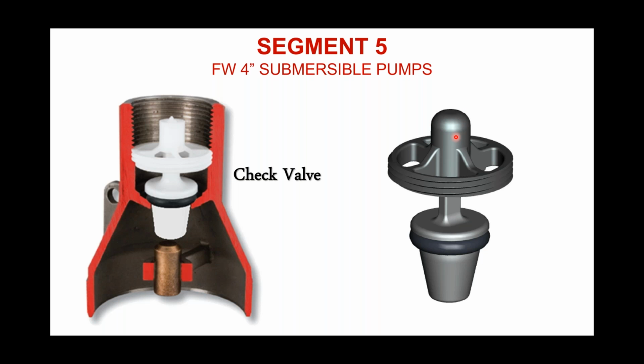For this reason, we do a lot of destructive tests at Flint & Walling. One test that we've conducted quite frequently when it came to these check valves is what we internally call the snow globe. Most of you know what I'm talking about. It's a little souvenir type of thing that kids really like a lot. You pick it up, shake it, and you see all the little glittery things slowly settle back down to the bottom. At least I've always referred to them as snow globes. We created a test at Flint & Walling that mimicked that. We hit the water with a lot of sand, a lot of fine sand, a lot of different coarse sand.